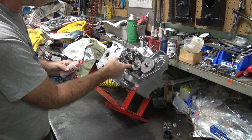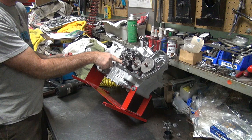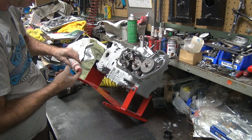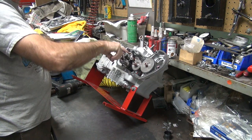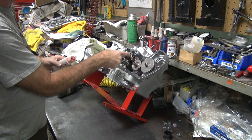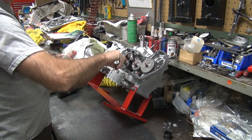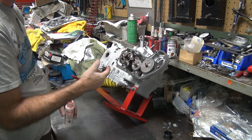Something I forgot to do was put lubricant on the oil pump gear down in there — totally forgot to do that. Put a little bit in there to get in there. You have to rotate the motor a little bit to get some oil in there now. Assembly lube. Make sure you get this worm gear up here also. Don't forget your pinion gear, even though technically we are shielded by that big gear.